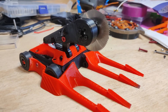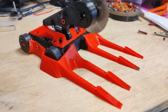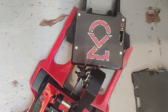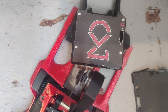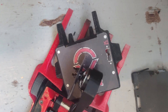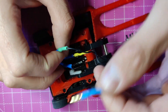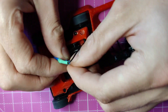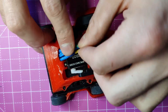A little bit of time has passed and the printer is now finished with all the parts. I've got everything assembled, so it's time to put this thing in the test box behind some rather thick polycarbonate. That was a little underwhelming — on closer inspection the saw is actually spinning backwards, so what we've done is melted our way into the chassis and got stuck to it. It's nothing that swapping a few phase wires can't fix, so I'll do that and let's try again.